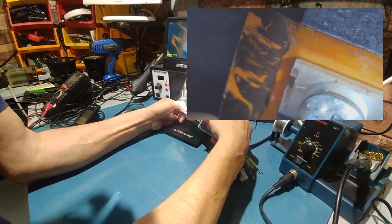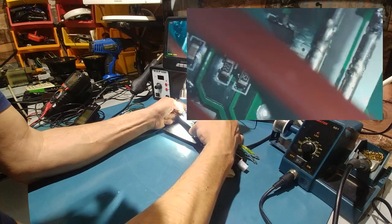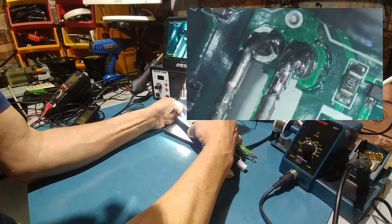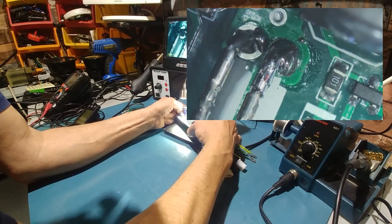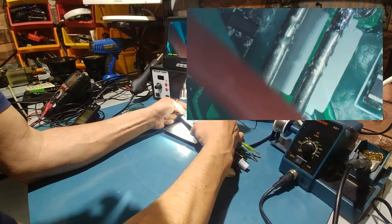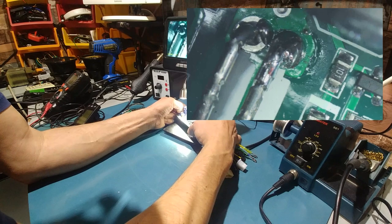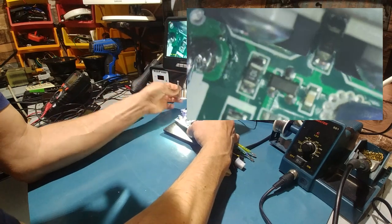I know I didn't do anything wrong. I've done this a million times and never had issues. Never had one blow up like that, though. That's hilarious. The shunt gave it away, guys. I mean, come on, look at that. It's only the one shunt there. So what he probably did is, like I said, he heated that up, pulled it, and then was running the one shunt on the other side trying to load their amps or something. I don't know what the hell he was doing here. But for me to look at that, he's even got flux on that resistor there.